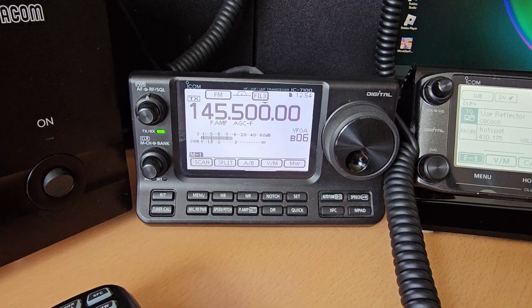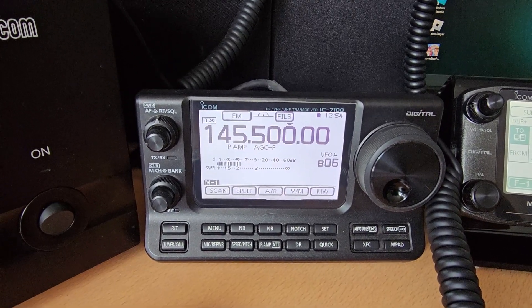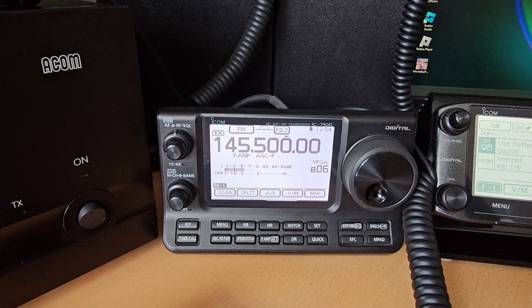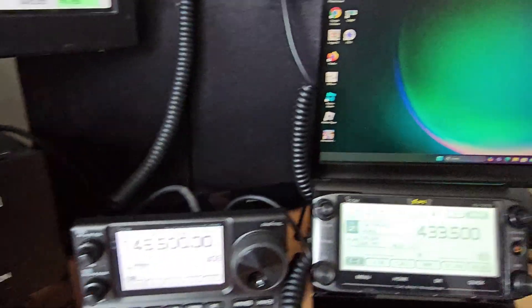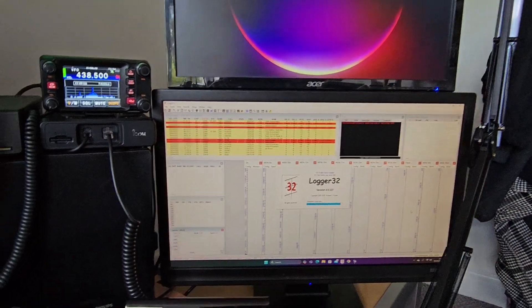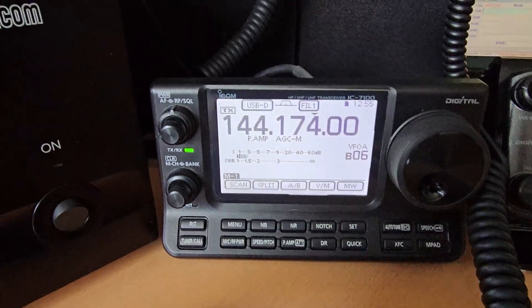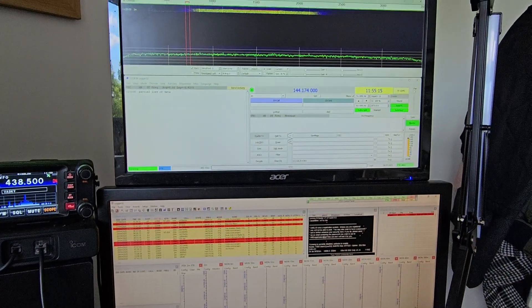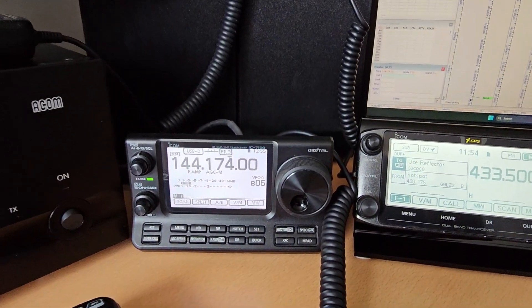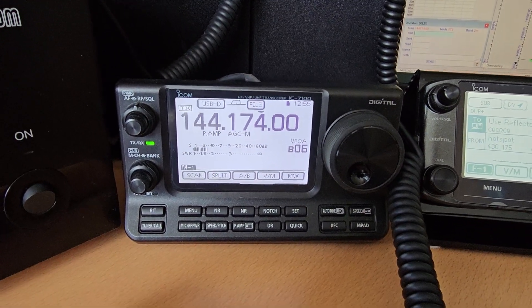The price for second hand and what you're getting for the radio is fantastic. It's so simple to set up on data modes - I've just got one USB connector going to the PC from the radio and it gives me full CAT control and audio as well going through the computer. If I bring up my logging software, it automatically brings up my log and you'll see on the radio when it boots up it automatically changes the radio frequency to FT8 mode. That's just done with one USB cable, so it's such a simple radio to use and the options it gives you are really, really good.